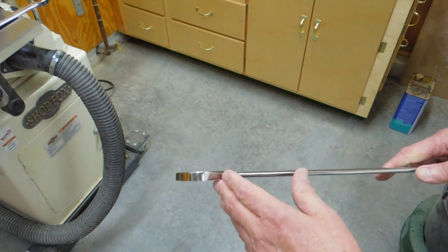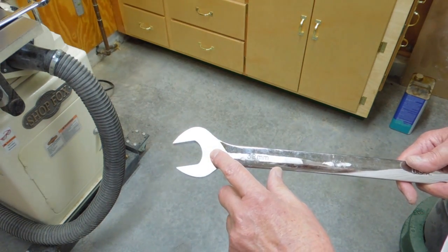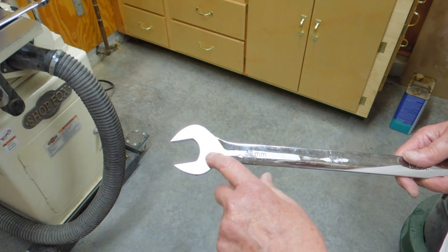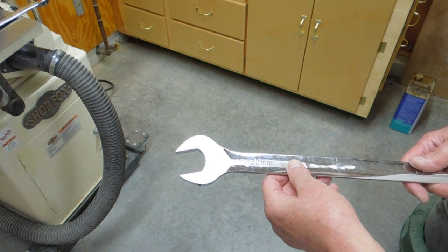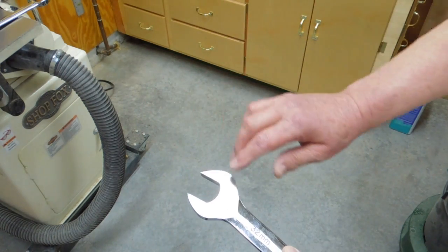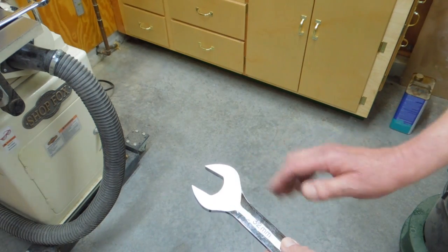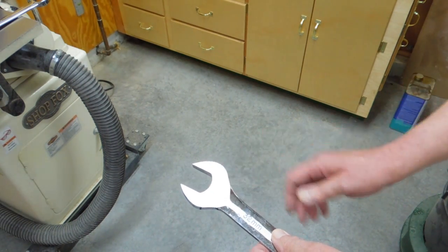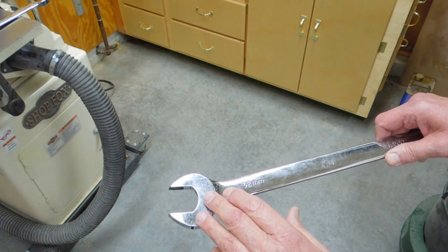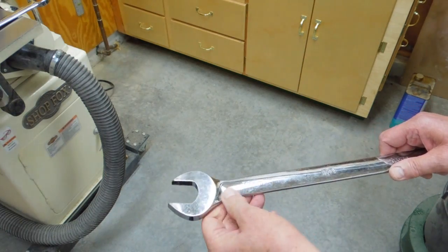When you grind on this, you're reducing half the thickness of this wrench. We do not want to take the temper out of this steel. If you see the color change on here when you're grinding, you've already screwed up — you do not want this color to change. When we're using the right angle grinder and you see the sparks flying off, those sparks are taking most of the heat with them. When we're on the belt sander, the heat will build up pretty quick and there's not as much heat being carried away. So you just have to be careful. When this gets too hot to touch, put it in a bucket of water, cool it down, and then start over. Make sure that this is dry whenever you're grinding on it.